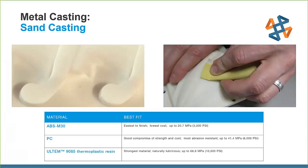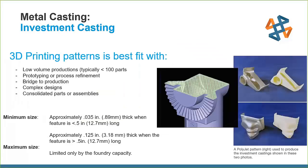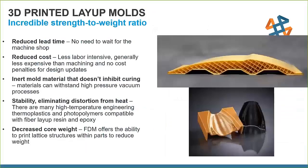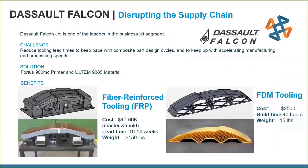Q&A: Are there any materials that could survive an autoclave, probably referring to the aerospace example? Absolutely — Ultem. Both Ultem 9085 and Ultem 1010 can withstand autoclaves. We have numbers on the temperatures they can withstand, CTEs, and other details. Contact us to work through how well it fits your scenario, but Ultem 1010 is the go-to for autoclave applications.